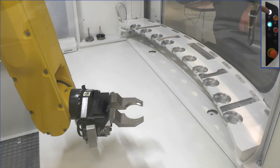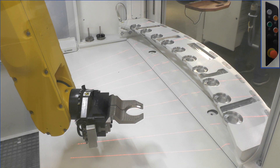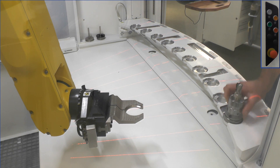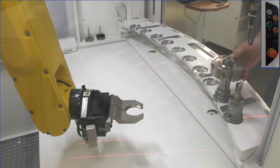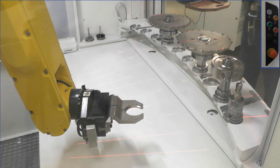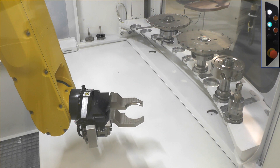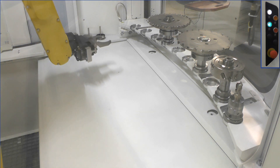To begin with, I now show how to insert the workpieces into the robot cell. After unlocking the door, I put the workpieces into level 0 and align the first tools to be machined using the laser line. Then the door is closed. A sensor mounted on the grip checks the occupancy of the lock and displays the occupied positions in the Process Manager.